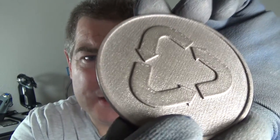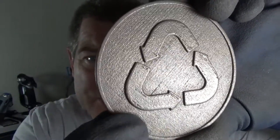If I had a rock tumbler — which I am building, by the way — and I had 30 hours to put it in there, it would probably come out much better. Some of the top layer started to split. What I'd recommend, if you're going to use this material, is to change the number of top and bottom layers to about five or six, because three doesn't seem enough. The wet and dry does take quite a bit of material away, and if it needs to be dimensionally stable you'll have to overcompensate in the dimensions. But I am very, very pleased with how it came out just with wet and dry and a wire brush.